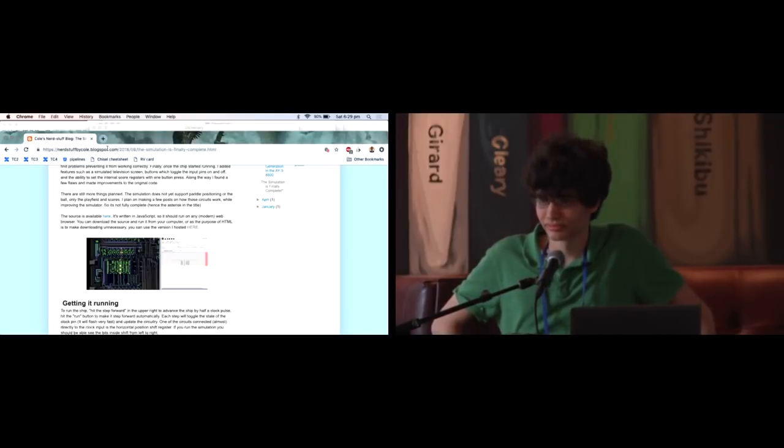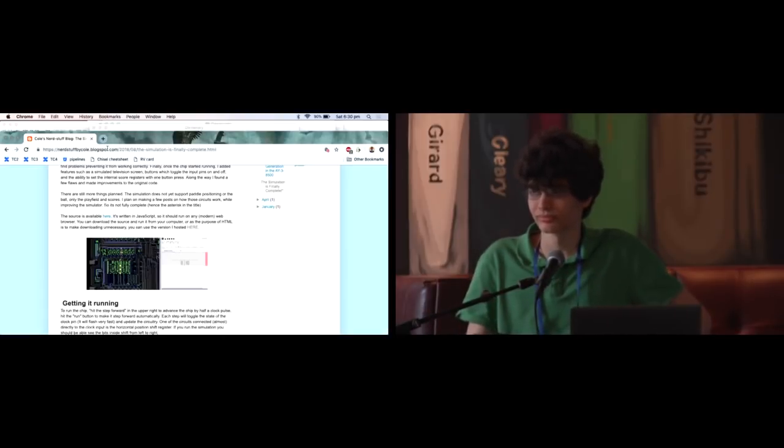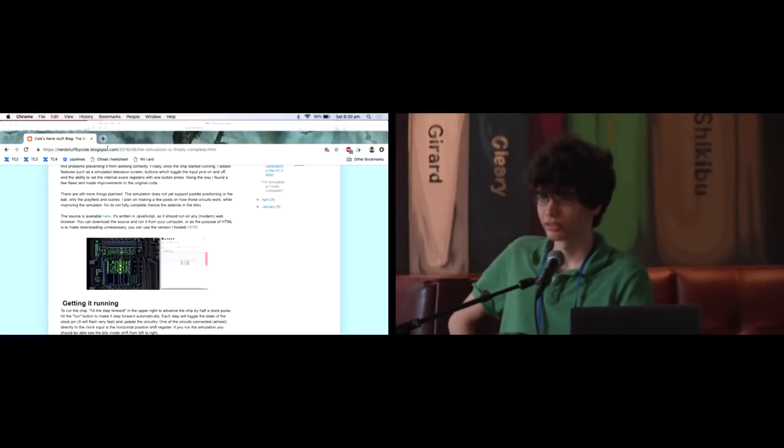Now for the real question. I'm curious about when you go from the paint stage to the simulator stage, how do you do the error fixing? Presumably you have transcription errors and so on. What's the process by which you go from something that doesn't put anything on the screen to one with actual recognizable digits? So the first thing is my processing programs will highlight some obvious errors. Like if it says a transistor is unconnected, it will color it a different color in the debug image so I can go and fix it.